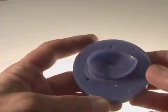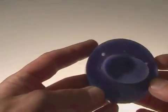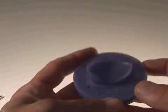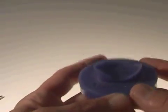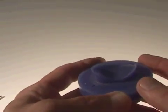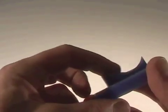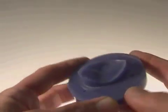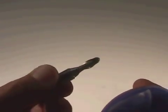Here's another interesting part made out of machinable wax — I think it represents the patella bone. Dr. Patashian was working on a project wherein they were growing cartilage tissue in the shape of the patella. They created a mold: this was the bottom part, and there was a top part. The two pieces came together leaving a thin little gap between them, and that's where the cartilage tissue was grown. It was created with a ball nose end mill.